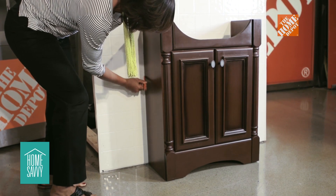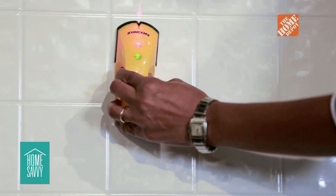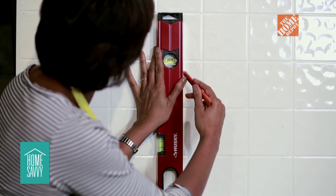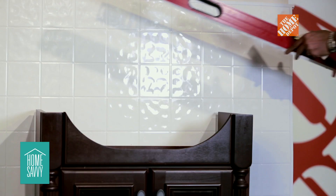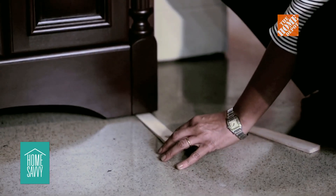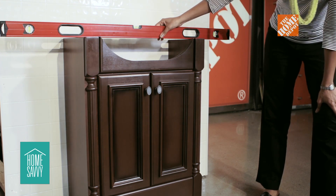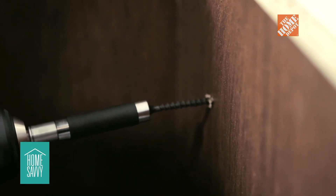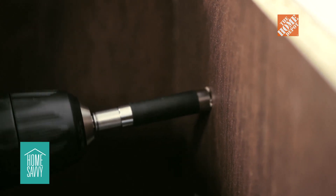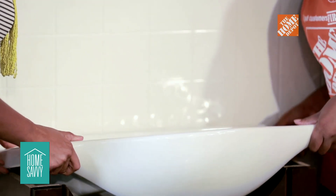For the installation process: first, put the vanity in place against the wall and trace its outlines on the wall. Use a stud finder to locate the studs to which you will screw the vanity. Then, with a level, draw lines along the studs from the floor to the top of the vanity — these lines will help you spot where to place the screws. Set a level on top of the vanity and shim at the floor until the vanity is leveled. Hold the level against the edge of the unit and shim at the wall until it's plumbed. From the inside, attach the unit to the wall by screwing three-inch drywall screws through the mounting rail into the studs. Check the level again before trimming the shims flush with the utility knife. If it's not level, add shims.